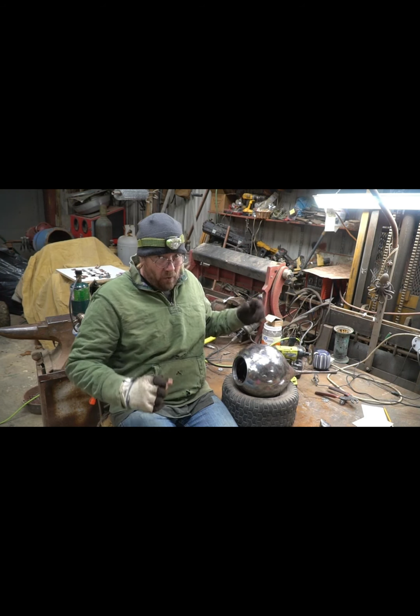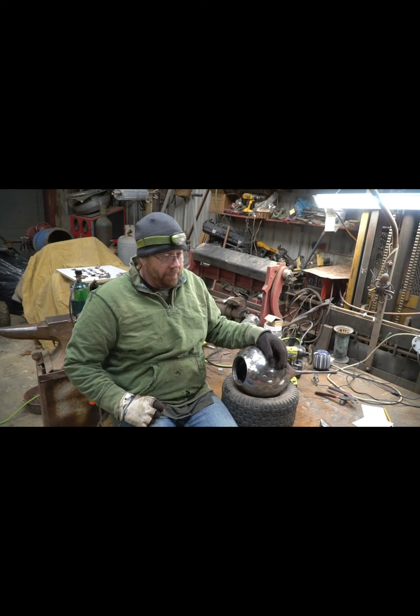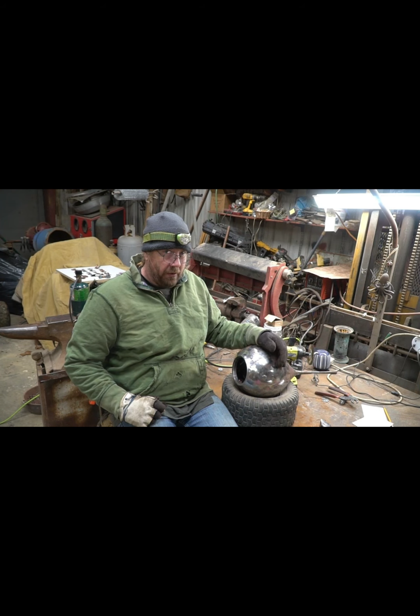and then heat fire the whole thing to a super red hot heat so it has an even mill scale. Wire wheel it down, lacquer it out, and I think this project will be ready for final assembly after a year. Thank God.